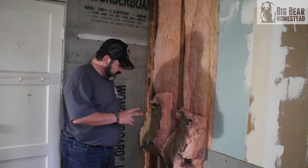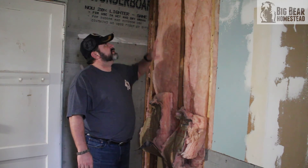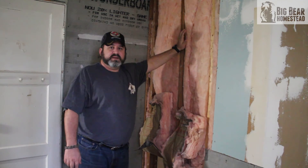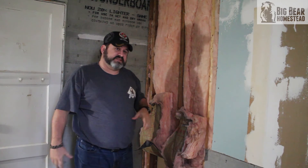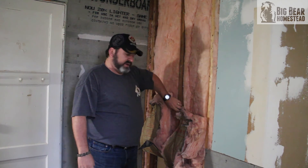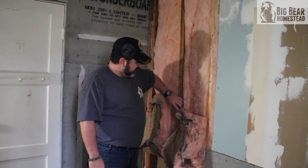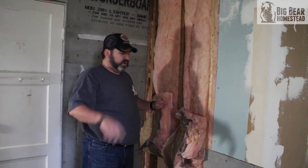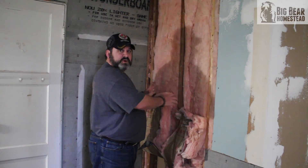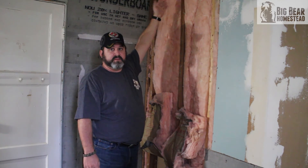We've run the lines up through, and we're going to stop right there because we still need to pick out the shower head. We've got to discuss it — I want that big mama-jamma one that's like a big thunderstorm coming down on you. Once we decide, we'll mount it here, chip out some of the stud a bit, extend those lines up, 90 them in — or if it's a two-knob setup, run up to the knobs and then up to the shower head.